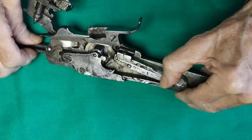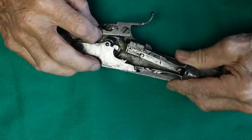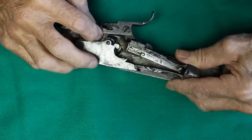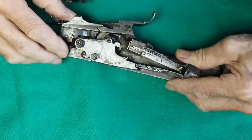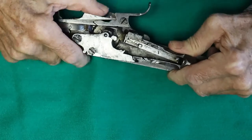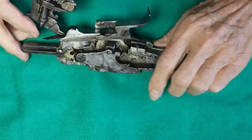The sear is a little pip that goes into a hole in the back of the wheel. On this one it's rather worn, so it's a very susceptible — not a particularly robust mechanism. The spring that locks in the pan cover is all very stiff, so it's a high-force structure overall. That's the wheel lock; now we'll put that aside.